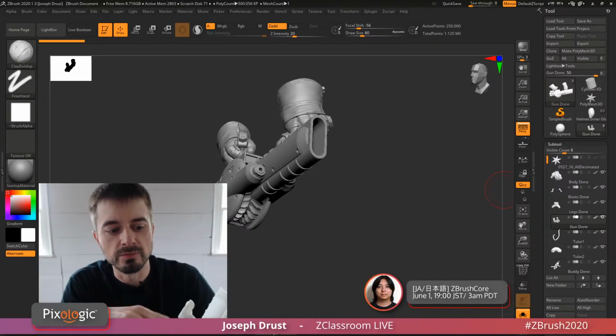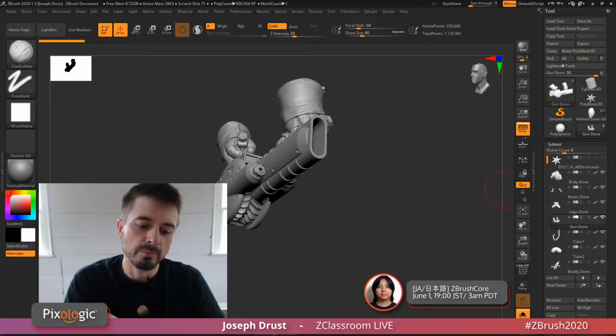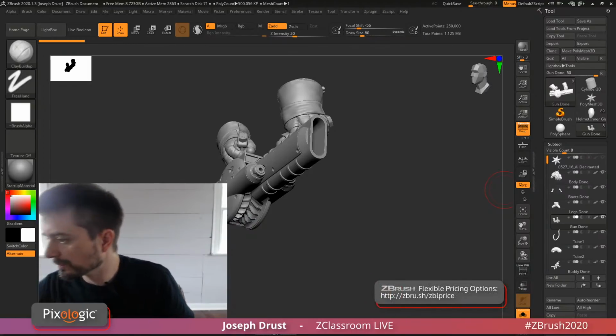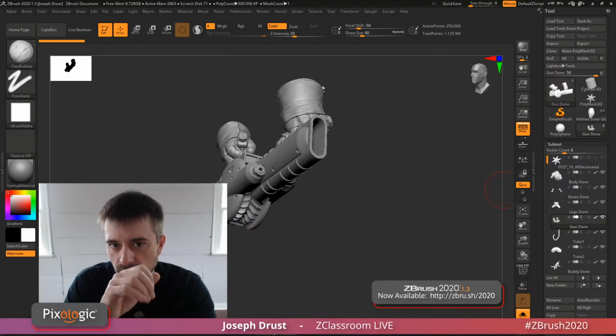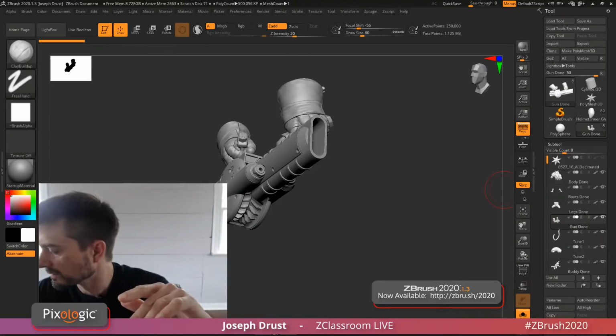Definitely where support hits, you're not going to get as much resolution as you had in other places on a mesh. But the trade-off that I find with Simplify 3D is that if you print with that, I can rip the supports off very easily. It's going to give you a lot of supports. You can over flood the supports, because I usually want more supports than less. But with Simplify, I can just take them and they peel right off. That's the biggest thing I like about that application for 3D printing.